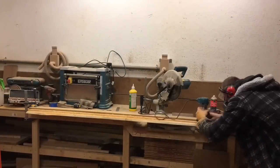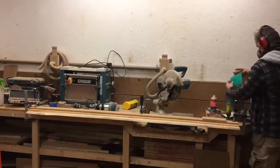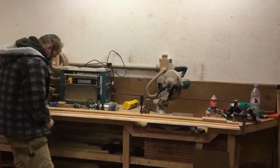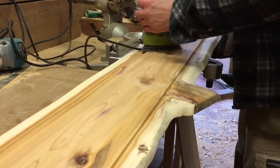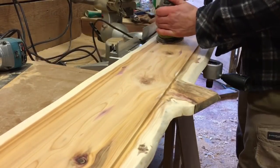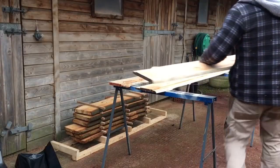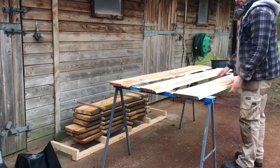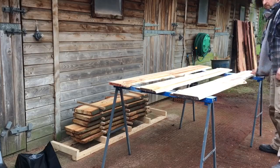I have to say yew is my favorite wood to work with so far. Because of the level of character in it, the color variations, the tight grain - it is a visually very attractive wood. To be honest, for me it's more attractive than walnut. Yew is also dimensionally very stable and less likely to warp or crack than many other species.